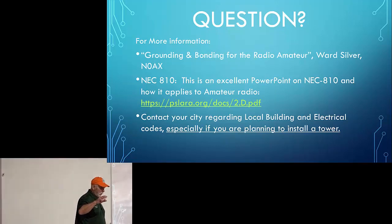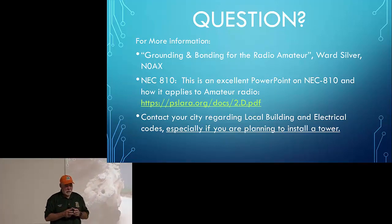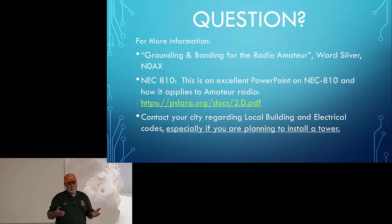Exactly. And what Bill's saying is that by putting an antenna tuner, and I'll use a vertical because that's where we typically see this, we'll put an antenna tuner at the base of a vertical. So between the radio and the antenna tuner at the base of the antenna, there's going to be the loss for that one trip down the coax. You can't get away from that. It hits the ATU, and the ATU has already matched the antenna, so all of that power doesn't make a trip back down the cable. It goes into the antenna where it's radiated.